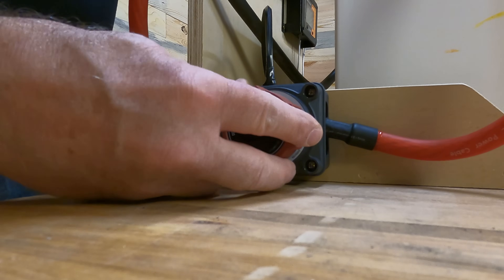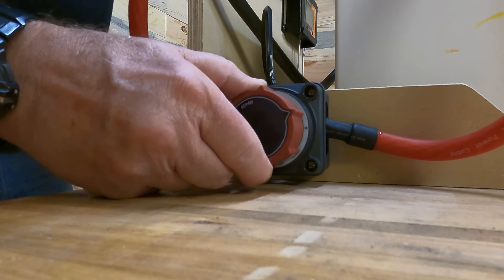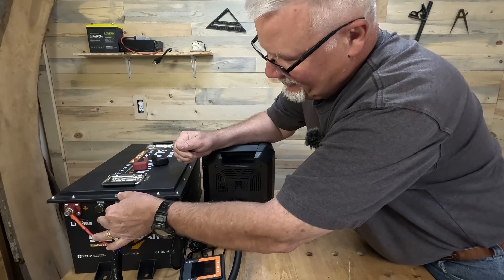Your battery should be off. If it does not have an off switch — most of the big 48-volt batteries I've seen do — but if it doesn't, I recommend putting one in-line. I'll drop a link below. Put it in between so that you can have that battery completely powered off and disconnected from the unit. Once you've connected them together and both are off, turn the battery on first — that's what I did — then turn the power station on. The power station should see that voltage.